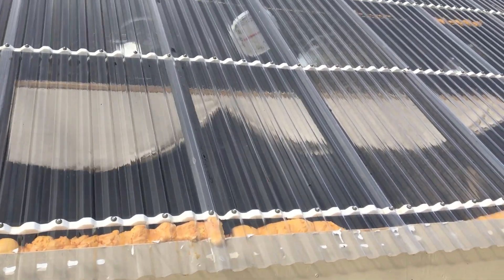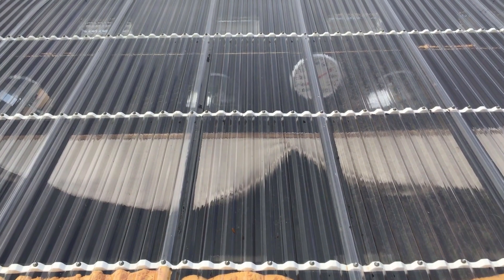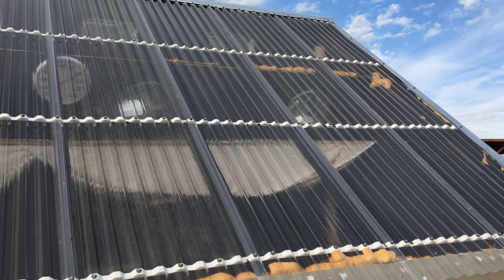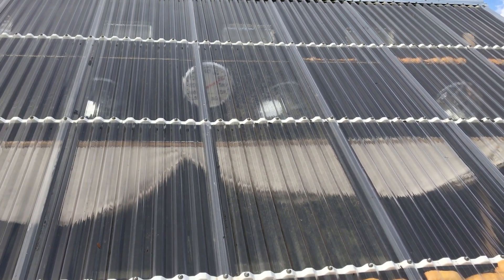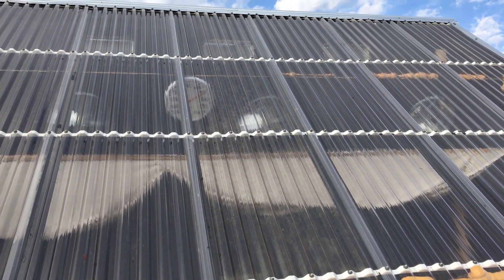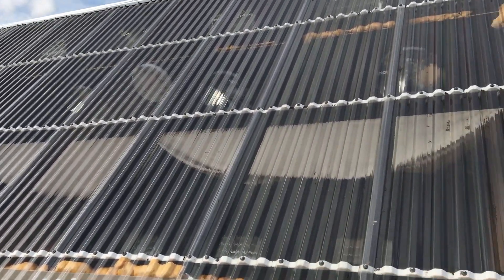It's a little like 81 degrees inside, and one fan is running. I've got all the fans set so that one goes on at 80 degrees, the one on the far right goes on at 90, back over here is 100, and the one right of the thermometer is 110. So they're not all running at one time. Now that I've closed up all the cracks and restricted the airflow, it may warm right up inside of there.